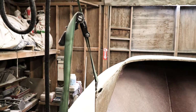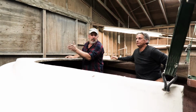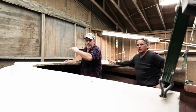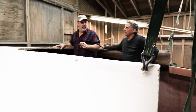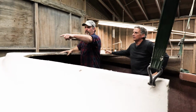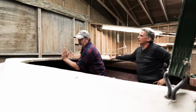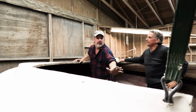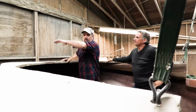So, Bill, we're going to bring the trunk up again here by what, 8 inches or so? We're typically at 8 inches. I'm almost at 13 when I do my measurement. So we're going to bring it around. This is a hard piece to make. I'm going to have to do this in almost 4 pieces, starting with the front. Because if you think about it, if I made one big piece and then I bent it around, what happens is the sides drop when you go to bend it. So I'll make this piece first, cut it, snip it.